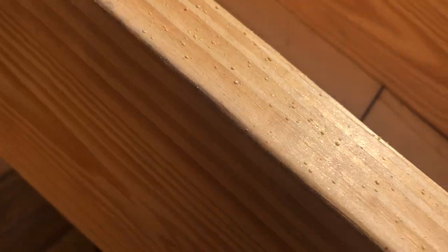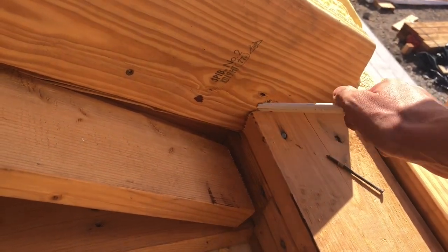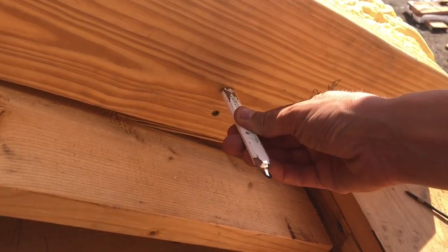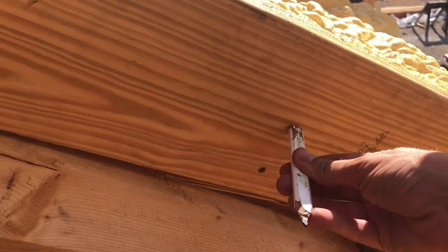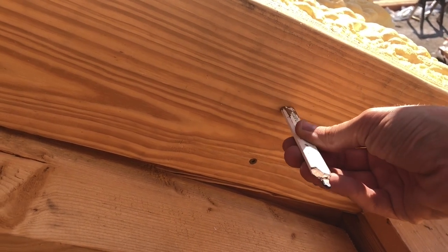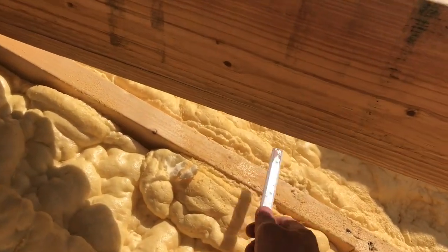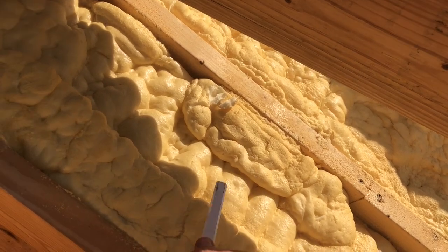This is the last attic rafter, and on the backside the Douglas fir beam was sitting lower — there's quite a bit of space. The vaulted ceiling was framed lower than the attic trusses intentionally. We put the tongue and groove, then ran electrical, then put a two by four on top of that. The two by four roof framed on top brought the level up so the two by eight from the attic truss and the two by four are now at the same height. That gave us room to run electrical and put foam insulation.